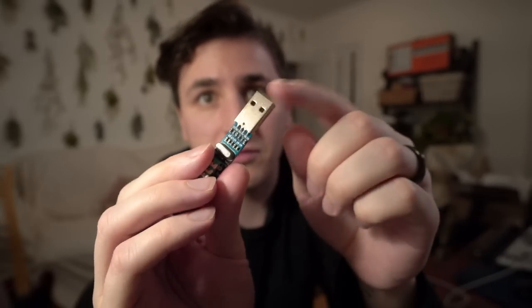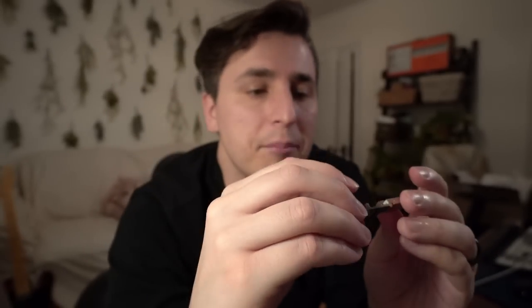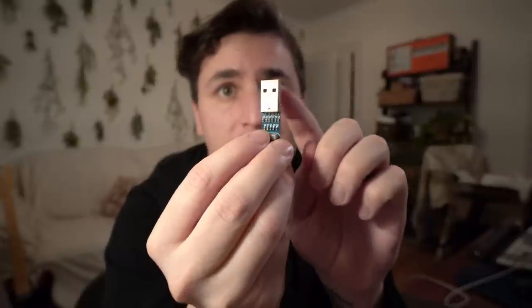This is just a USB sound card, so you would plug this into your computer and you'd plug your headphones or speakers into here. I'm actually going to desolder the USB jack because we don't have room for that. And I am also going to desolder the headphone jack because we also don't have room for that. So the USB side, I'm just going to solder it directly to the Raspberry Pi's USB port. And where the headphone jack used to be, I'm going to just wire that to the iPod's headphone jack,